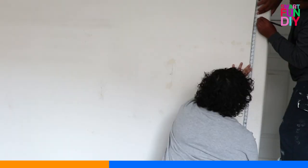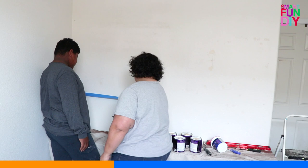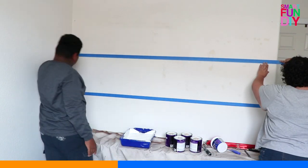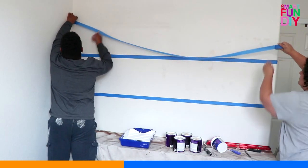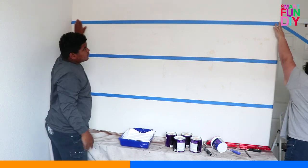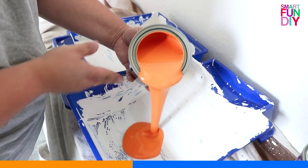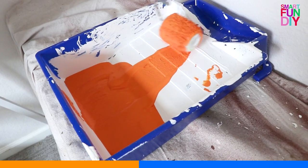This is a project you can do by yourself or get your kids involved. Because Matthew's 12, he's going to be doing the bulk of the work. First, have your kids spackle any holes in the wall, then mark the distance between each of your stripes. Use masking tape between the stripes — line them up with the marks you made and put the masking tape above and below the marks on every other stripe. Then you'll paint the other stripes in a second round.